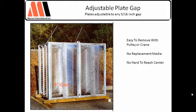The next slide shows a client who said they can't put time into maintenance — they only want to maintain this stuff every couple of years. So what we did was grow the coalescer a little bit and put in every fourth plate, ending up with a four-inch plate gap. They got an oversized coalescer so we could still give them the efficiency they needed to get down into low PPM range, low maintenance every couple of years, and it was still operating. And there was room for versatility, so in the future if anything changed, they were in good shape.